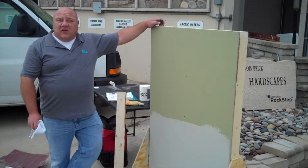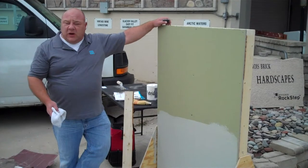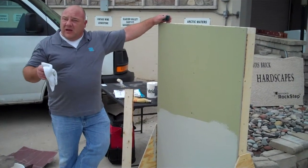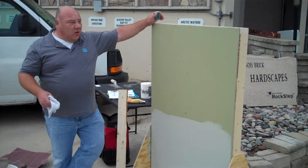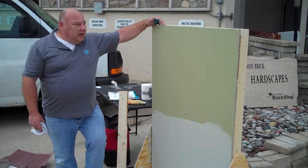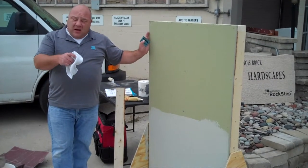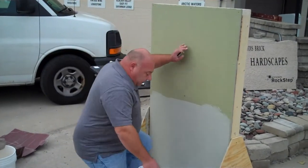When you have a poured concrete wall or a tilt-up cast concrete wall construction, typically they'll use form release agents. Basically those become a bond breaker. So either you need to get those off or you need to anchor metal lath or cement board to the wall. Then the waterproofing membrane goes on top of that, and we're the only waterproofing membrane you can actually adhere to, and we will warrant our product adhering to our waterproofing membrane. So we're going to let that dry.